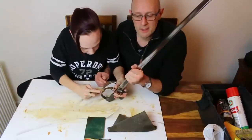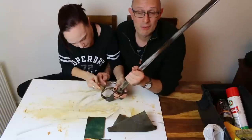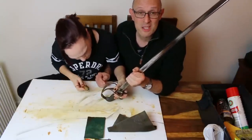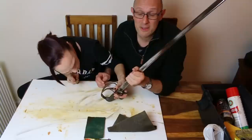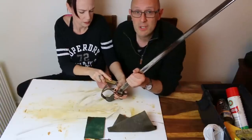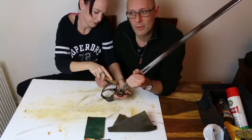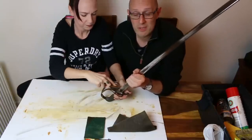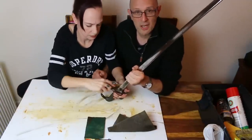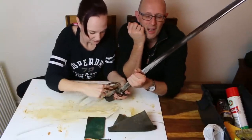Now, one of the drawbacks, of course, to cleaning the rust off is, to some extent, you're going to abrade and slightly damage the bluing that's underneath the rust, but there's no real way around that, because you've got to clean the rust off, and the only two ways of cleaning the rust off are with some form of abrasion or with a chemical, and both of those things are going to have some effect. But you can re-blue stuff, though, can't you? You could re-blue it, but...